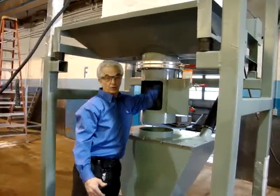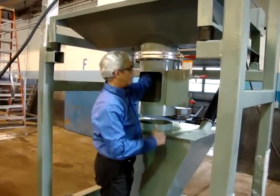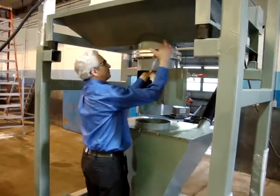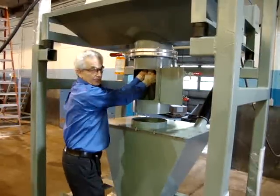The petal closure is already untied as I did before outside. I'm now grabbing that knot with the discharge spout and pulling it down — you can just barely see it here. Now I'm going to close the iris valve on that. The iris valve is completely closed; nothing can come through here.